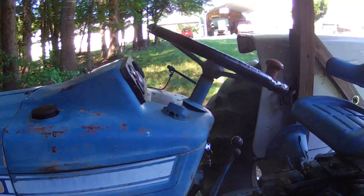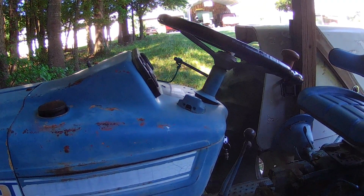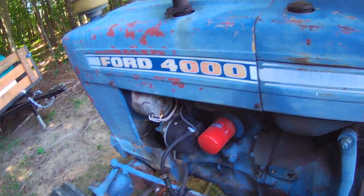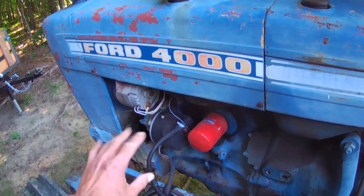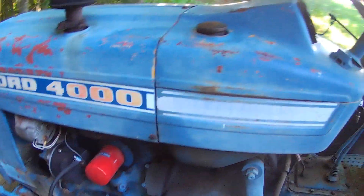For the new subscribers that haven't seen me spraying and how I do it — I don't have a working tachometer. On a Ford 4000 the tachometer runs off the generator, and I got rid of the generator and put an alternator on it. It's a whole lot better charging system. Well, there's no place to put the tach.